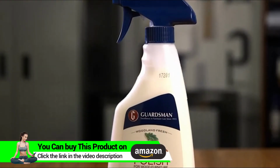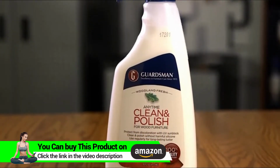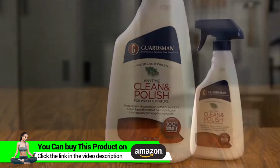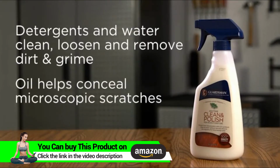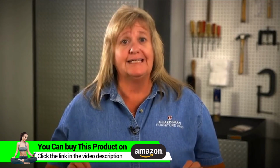Guardsman Anytime Clean and Polish is a water and oil emulsion product that contains detergents, water, mineral oil, and UV inhibitors. The detergents and water clean, loosen, and remove dirt and grime. The oil helps conceal microscopic scratches, and the UV inhibitors help prevent the wood from fading. There are no abrasives in our polish to harm the finish, no wax to build up and dull the finish, and no silicone to contaminate the finish, which would make future touch-up or refinishing more difficult and costly.